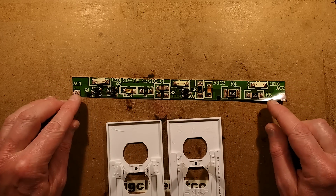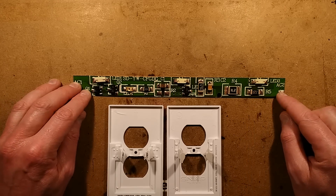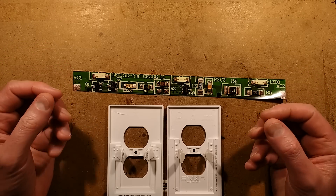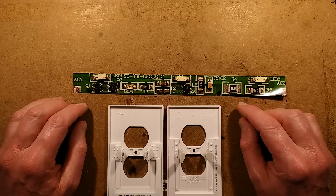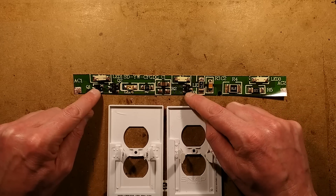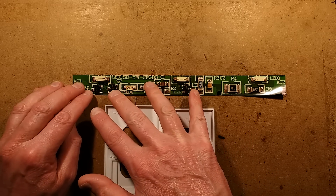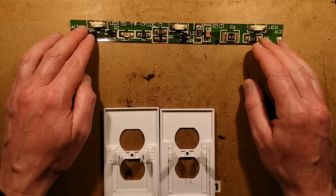As a quick recap on the original circuitry: it was based on a little circuit board in the bottom. The main supply came in, went through two resistors — possibly one as a fuse and one as inrush limiting — then through a tiny capacitor as a capacitive dropper. On 120V AC, the peak voltage across that is 170 volts, which is quite high for that little capacitor. Then there's a bridge rectifier made of two diode sections, a smoothing capacitor, a light sensor, a transistor, and a resistor forming a bridge. It shunts current across the LEDs during daylight; when it gets dark, it goes open circuit and current flows through the LEDs to light them.